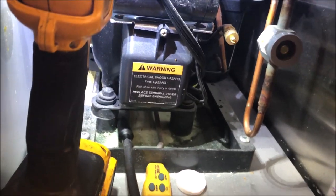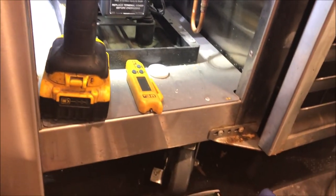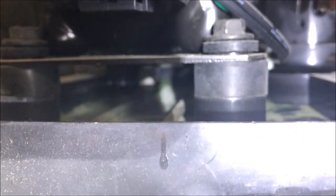Looks like we finally zeroed out the meter, so now we have a better chance of picking up the leak — and we're not getting any hits here anymore, which is interesting. What most likely is happening is the evaporator is leaking. I'm going to try to zoom in and get the drain tube. Basically, if there's a leak in the evaporator coil and oil has leaked out, it's going to drain right into this condensate pan. There's our drain tube.